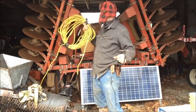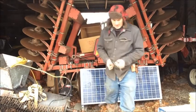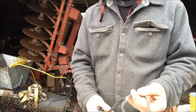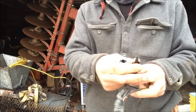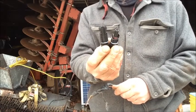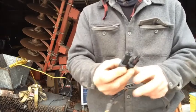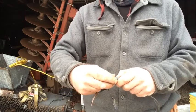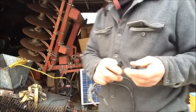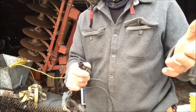I've got a lab extension cord about 100 feet or so. The tractors are way over on the other side of the barn. One thing I did is I had used wire nuts and taped all these leads together. When I first bought solar panels, I didn't know about these MC4 connectors — you couldn't buy them anywhere locally, you had to order them online or go to a solar specialist. So I had cut the ends off. Your solar panels come with these connectors on. The nice thing about them, you can quick connect and take them off. I'm going to fix all this, show you how I crimp them, and then show you a charge controller I use to regulate the charge — that'll act like my battery charger.